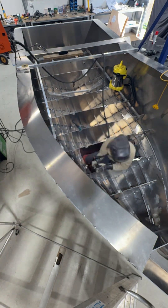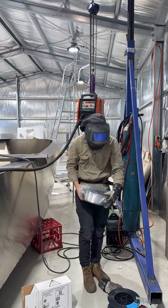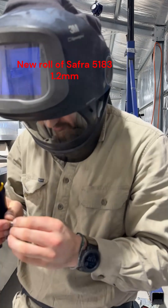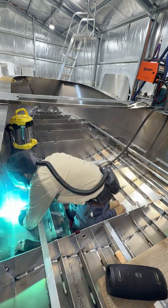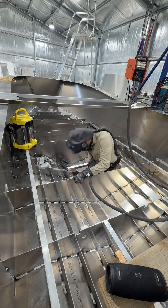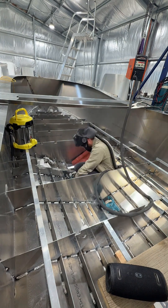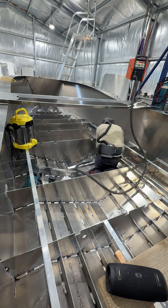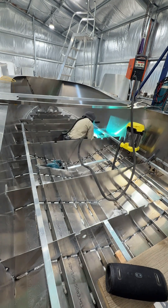I moved forward section by section, jumping back and forth to try and spread out the heat. That chine weld only took me probably an hour and a half for the whole thing. This whole welding stage one process was probably 20 hours all up, and took a roll and a half of wire — a 6 kilo roll — which is equivalent to about 15 kilos of normal carbon wire, and probably a bottle and a half of G-size argon as well, including all the tacking.